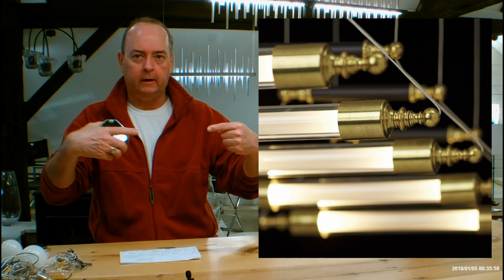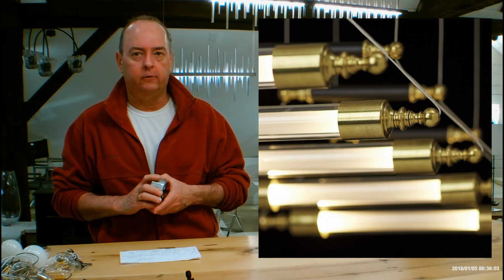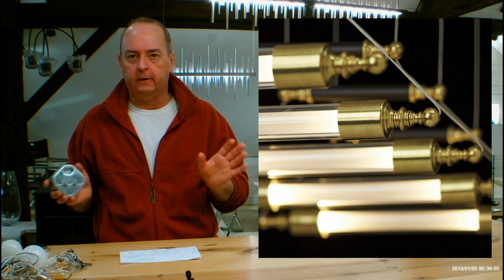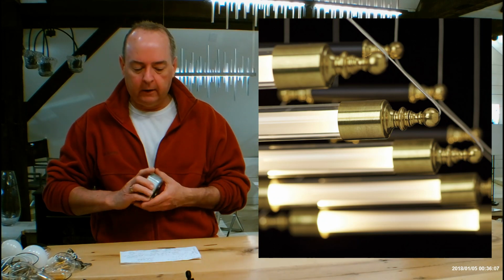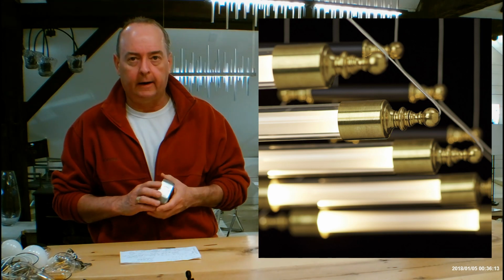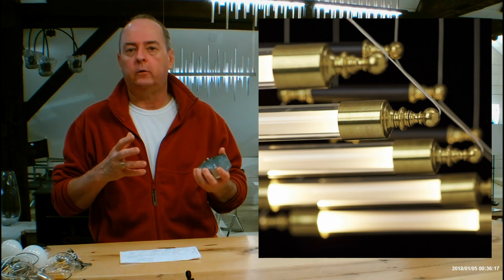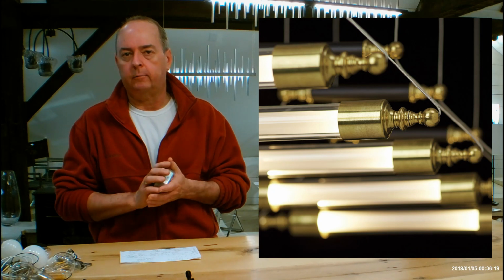There's one on each end facing each other. Those are going to be equivalent to 20 watt halogens each. So you add them all up. Don't forget, you've got 5 of these. There's 2 each. It's going to give you the equivalent of about a 100 watt halogen bulb, which produces more lumens than what you're used to as a 100 watt regular incandescent bulb.